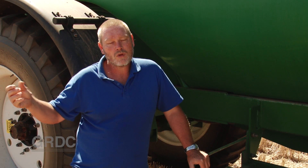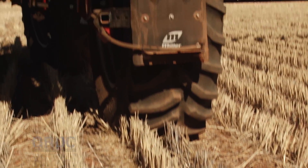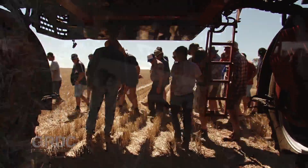If you've got it right out in the boom in terms of droplet size and volume, that's a great indicator. Then when we come in and look at the wheel tracks and what's happening around the tyres and the centre of the machine, sometimes we can see some differences which we might be able to improve with some of our knockdown products by adjusting where we put the spray or maybe increasing nozzle size in some places.